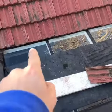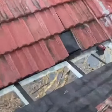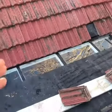The problem lies between — if you can see there, there's a piece that's just been taken out. There's an angle over there. The problem lies in that right angle over there, where water is going underneath that flashing.